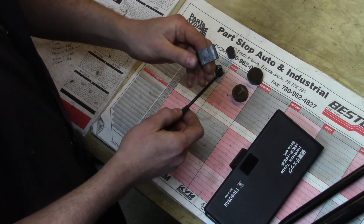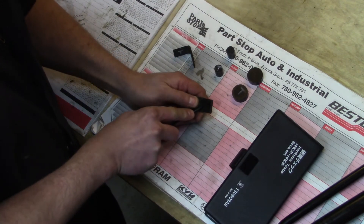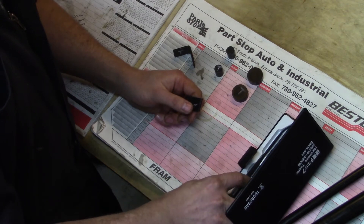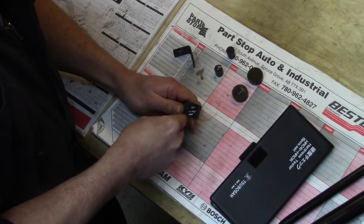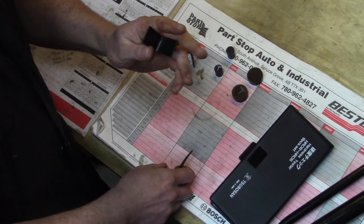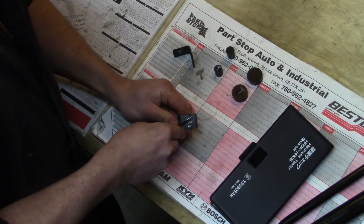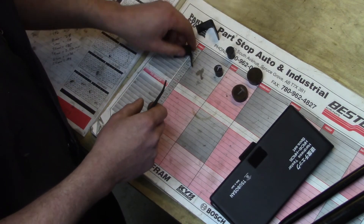I'll start with our bed frame piece — this was not run through the oven, just through the attempted hardening process. The 65 Rockwell file bites in, and the 40 also bites in. So that one there, I guess, can't be hardened — or maybe I didn't get it hot enough because of the surface area. Either way, I don't have to worry so much about this stuff.